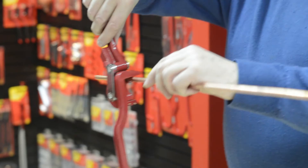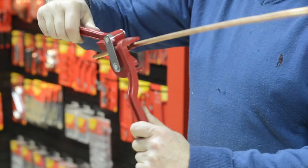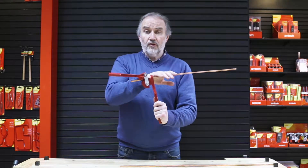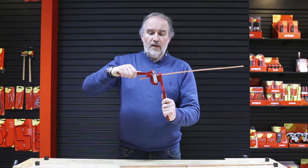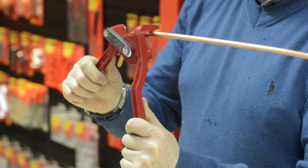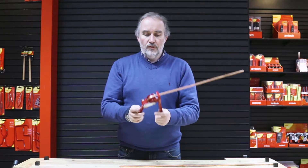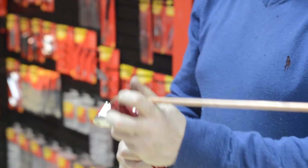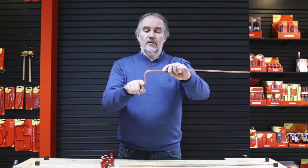I'm going to put the copper pipe in here and bend it round. You can see here how it's caught. The knack with this is making sure your copper is fairly fresh - otherwise you can anneal it, which means you put it into a flame and then into water to soften it. Then just go slowly because you are stretching metal. There's a scale on here which has 90 degrees marked, and that's where we started from, so we've bent to 90 degrees.